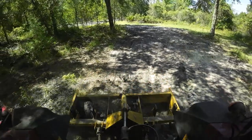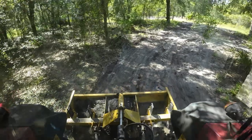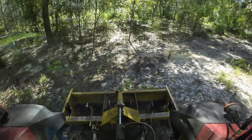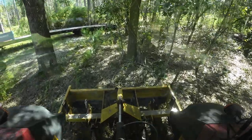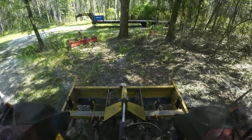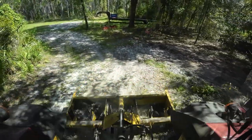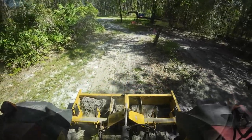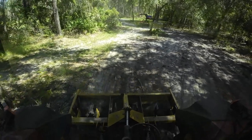For those of you that don't know, on tractors like the Massey, you've got your lift arms that raise and lower your implement on the back, and on a slightly more advanced tractor like this one, I actually have a knob which controls how much downward pressure there is. If I set it to light, the tractor will pick up the implement so it doesn't bury itself into the ground. When you're doing something like plowing, you want all of the weight down so it won't pick it up. It'll just let all the weight of the implement ride on the ground. When you're bush hogging and you want to be careful not to hit stumps and things like that, or you're box blading, it'll pick up your implement for you if it encounters something that could potentially cause a problem. I would also think, when you're root raking or landscape raking, it's helpful so your rake doesn't get too deep into the ground if you're just trying to scratch the surface.